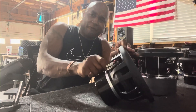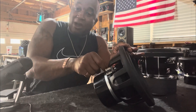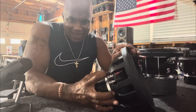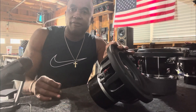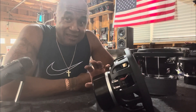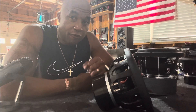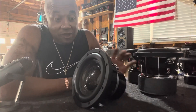Even if you limit the surface area of the magnet, you can see my hand flexing — you're not pulling it off. The only way you can get it off is to slide it down to the non-magnetized side. And this is a very small piece of neo here, but that does not belie its strength. So the advantages are significantly more strength in the gap for more force, even though we're using a smaller diaphragm. You can use neo.